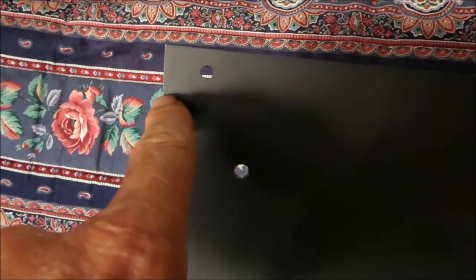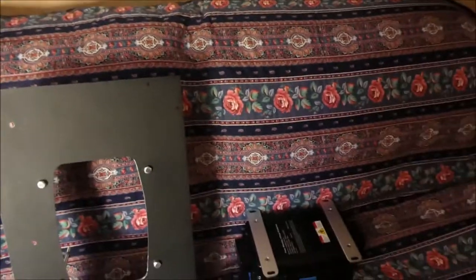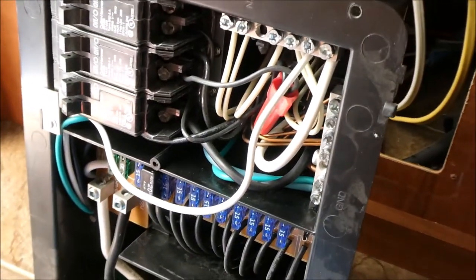I think I'm going to cut both the top and the bottom off because they have these extra holes here that I'm not going to use and I just can't stand it. That one on the bottom is going to show and I just can't have that, so I'm going to cut this off. It'll look a little bit more like it was meant to be there. I just cut 5/8 of an inch off the top and off the bottom, and I opened these three mounting holes up to 5/16 for the quarter inch mounting bolts.